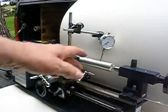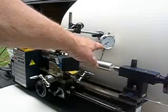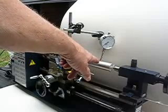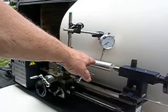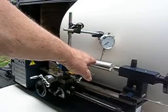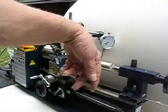I don't know whether you can see that needle on that dial indicator or not, but it's just about 2 or 3 thousandths off. And I'm out about 10.5 or 11 inches on that piece of bar, that magnesium bar. It's about 94.5% magnesium, almost pure. But I've got it in there, and I'd certainly turn it at that.